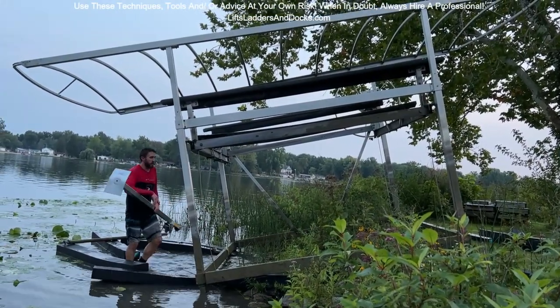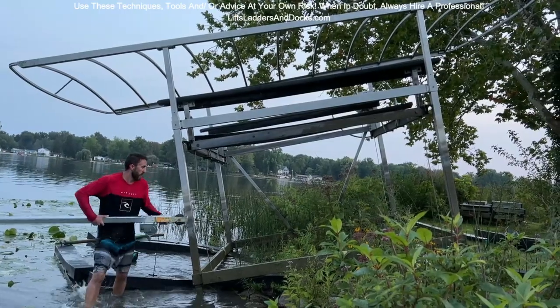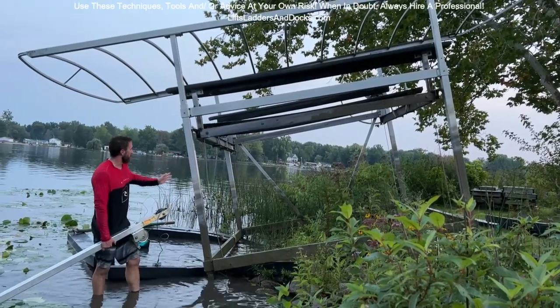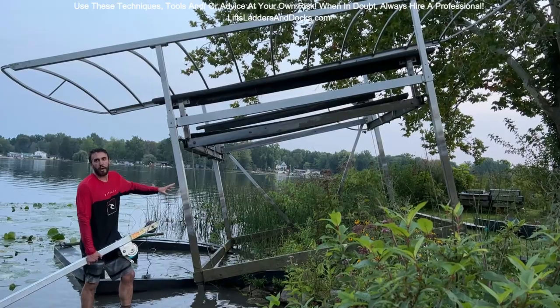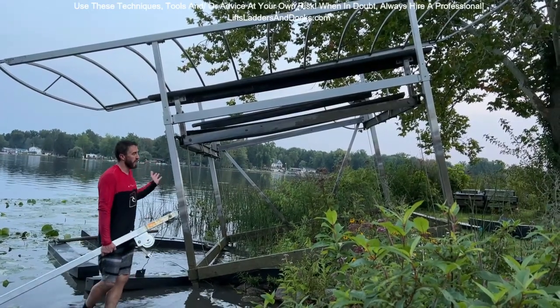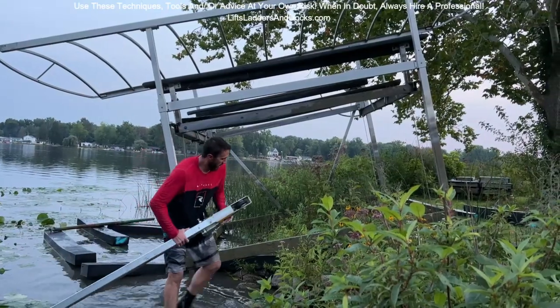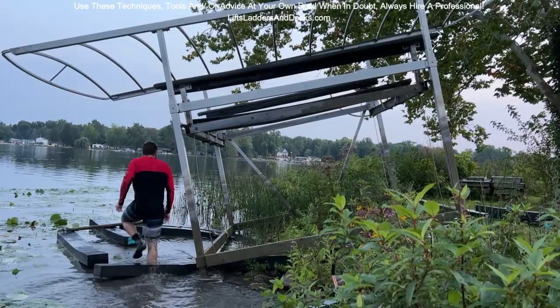In this case, it's just gonna be better to keep going with the pipes. But otherwise, that would be where you transfer over. And then you may be able to jack it up, especially if it had a vertical steel wall. The crane is tall, get your pipes under there so you don't break your back lifting to the height of the wall and just shove up and forward. So that's the main principle there. See if I can get this last little bit.